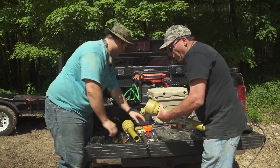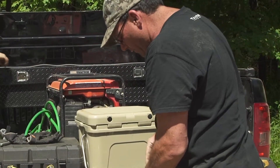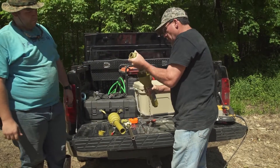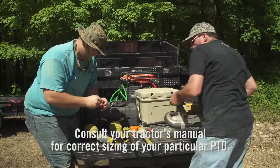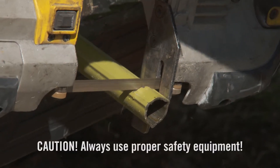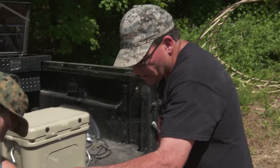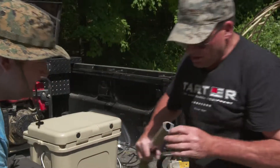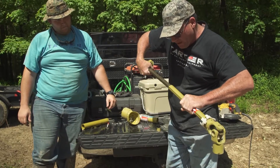We're going to go back and remove the shield off of this PTO shaft. All we have to do on this particular PTO shaft is push in on the three locking tabs. Once you get all three pushed in, it'll slide off the whole coating. We're going to mark it up one inch and repeat the process on this half of the PTO shaft. Now we're going to cut the plastic off of this side. We need to clean up the inside edges of this one — make sure they are burr-free and will slide properly up inside each other.